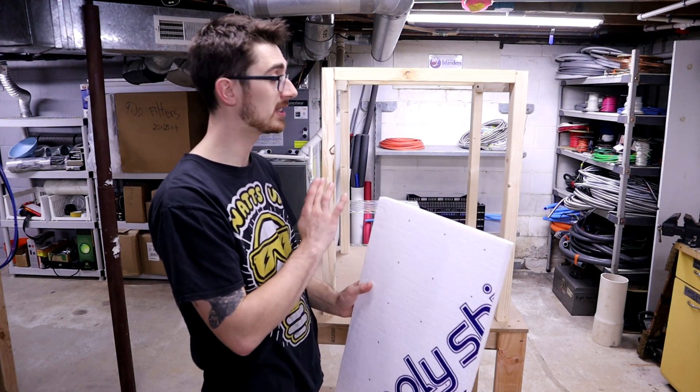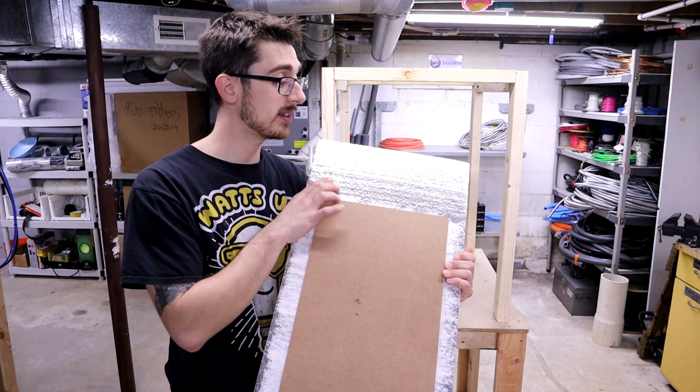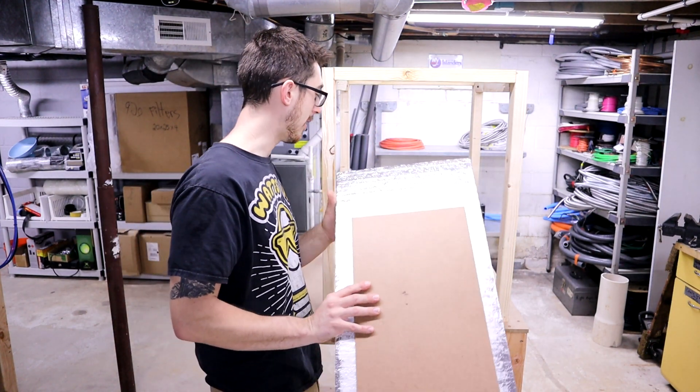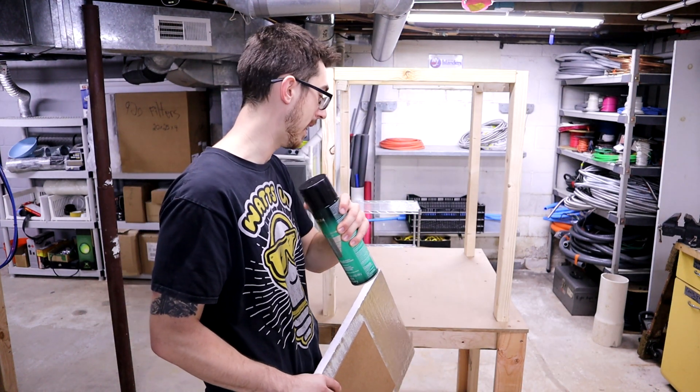However, the two sides and the front are all going to be doors, so I attach this 1/8 inch firm board to the insulation board. That way it stays rigid over time and the doors don't want to flex as you're ripping them on and off. I attach these two by using some contact adhesive that had worked for my last enclosure that I built a while back.